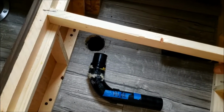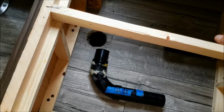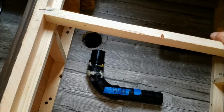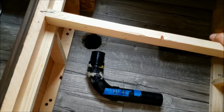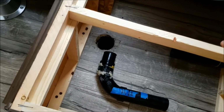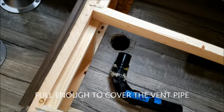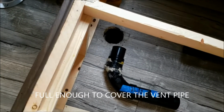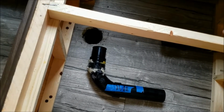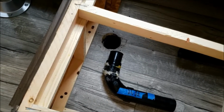So I put a little inspection camera I got from Harbor Freight down inside through the toilet and looked over where the vent leaves the tank, and it is like an inch into the tank, which means your tank can't fill anymore without backing up through drains if it gets full and no air can escape. So I did a little calculating, and on our gray tank and the black tank, that 1 inch penetration with the vent pipe will reduce the capacity of our tanks by about 5 gallons if you're on level ground.